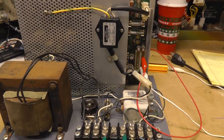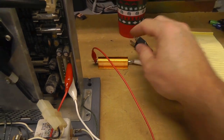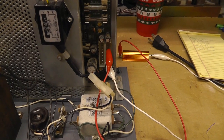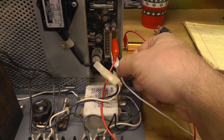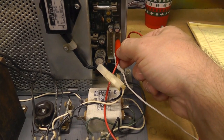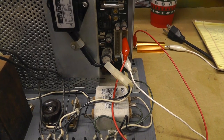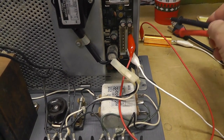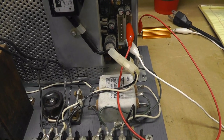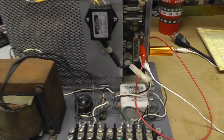To test this I basically wired up a 1-ohm resistor on the 5-volt line — one lead to ground, one to positive — which equates to about a 5-amp load, since 1 ohm equals 5 amps at 5 volts.